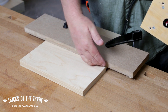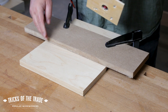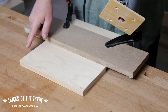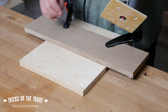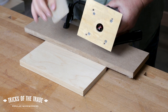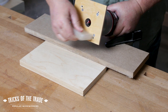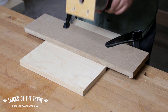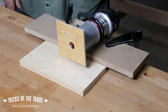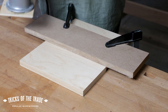I'm going to make four passes using this as my guide edge. I'll use the zero edge to make the first pass all the way, then turn it, make the next one stopping partway, partway, and partway for each step, so you can see how it widens out as we go. A little tip for any plywood base: a little bit of paraffin on here makes it work a lot nicer. Super simple — we're ready to go.